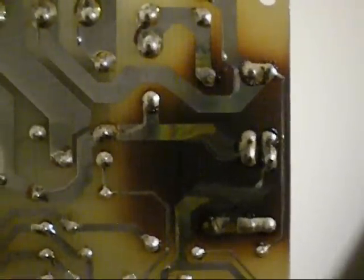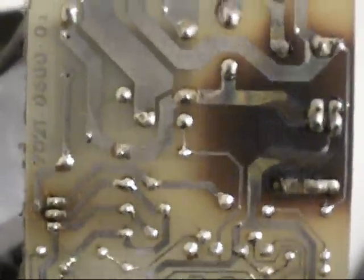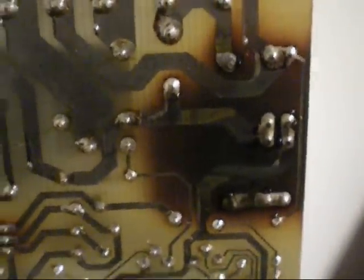It's been a little bit hot over the years, just being on all the timers they've done. A little transistor there has been hot, and all the resistors got quite warm and obviously baked something. This might be another little project for Ed — it should be fairly easy to replace these parts and that transistor, still got the number on it. Fix up the circuit board and see what happens.